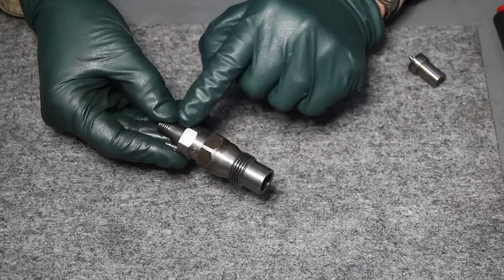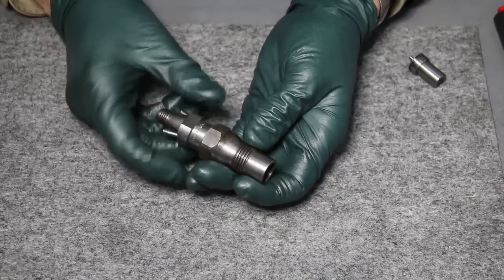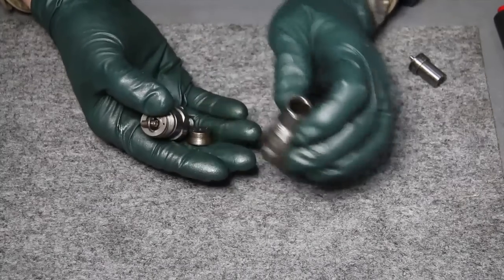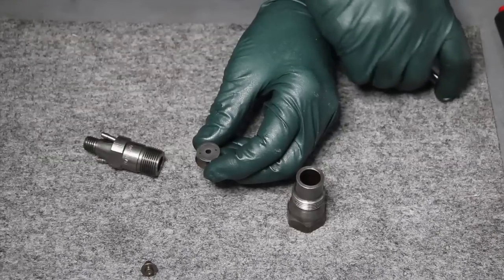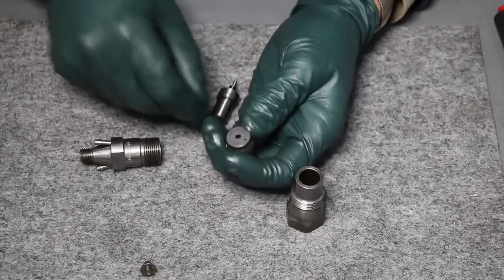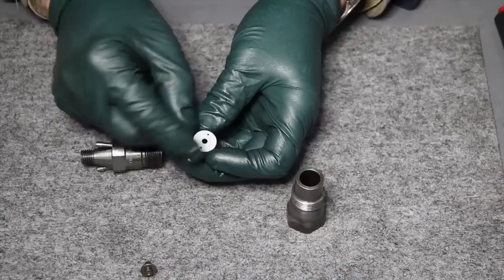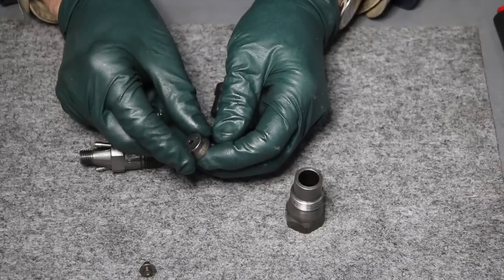Let me explain some of the problems we're seeing with these injector housings. You have the upper part and the lower part, split in the center — this is how you separate them for overhaul. There is a problem we're seeing with this centerpiece, which is what seals the nozzle. There's no gasket here; the nozzle has to seat right there on that centerpiece. We're seeing a lot of these that are either scored or rusty and pitted. If you have deep scoring or pits in the centerpiece, you have to reject this piece — if you try to use it, you're going to have problems with your fuel injectors.